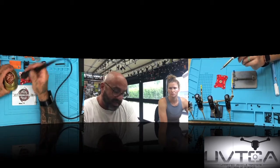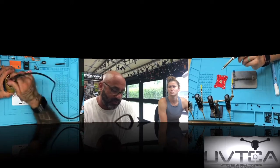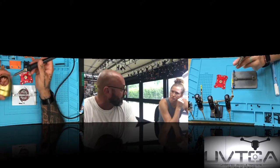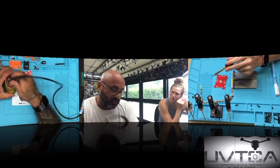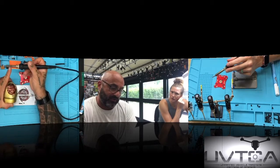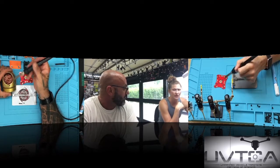What they do is they scrape solder off. That solder remains in here. So as you use this, you scrape off the extra, but you re-coat the tip with the solder so it stays nice and silver. You want it to re-coat so it doesn't oxidize. If you don't clean this and re-coat it properly, you see how the rest of my stuff is oxidized like here? It'll all look like that, and once it's like that, it won't transfer heat properly. Do I do that after every tap? That's what you're gonna do.